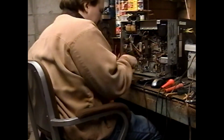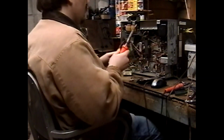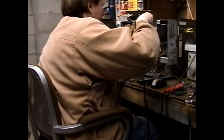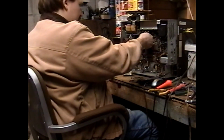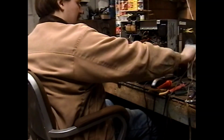We will continue our practice of clip the secondaries and solder the primaries. Not for any reason other than it's what we're already doing. One thing that just occurred to me is I should disconnect the old secondary winding from the original transformer, because if that transformer happens to have a short in its windings and it shorted before it went open, it could mess with the effective behavior of the new transformer. So let's give this a try.